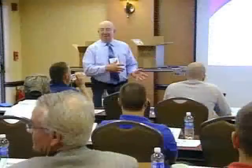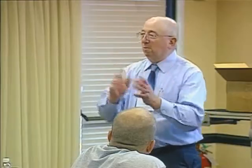When you talk about modular, you're talking about years before you may have to go in there and replace a belt. You just hope their maintenance is lousy and they break a bunch of modules. But even when they break a bunch of modules, all they're going to do is buy a few modules to repair it and keep that same belt running. Yeah. There are modular belts in operation out here that we have seen that have been on for 20 years, and all they do is replace a section and another section and another section, but the same basic belt is there. It doesn't change.